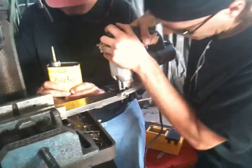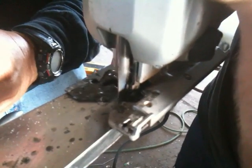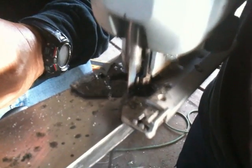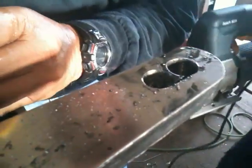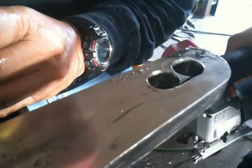The next important point is to keep the blade always cutting. You do this by slow speed and high pressure. If at any point chips stop coming, check the blade for sharpness. If it is dull, replace the blade, because we want to refrain from work hardening the titanium on the cutting face.